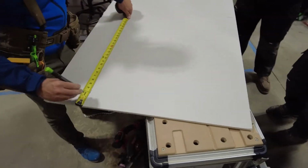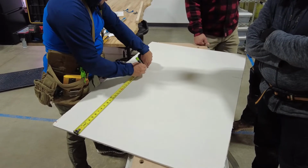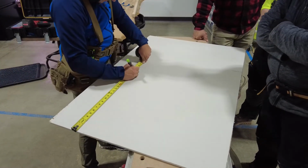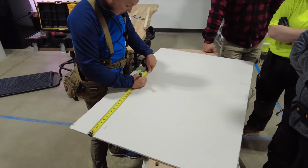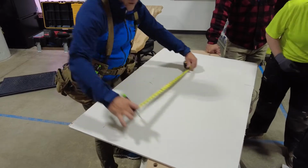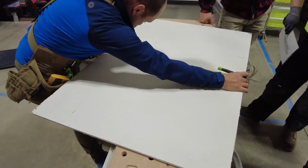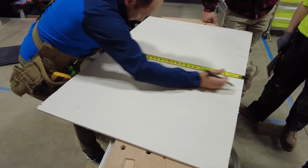All right, here's a little trick. I'm going to use pencil lead. This is a straight edge, right? I let it come off a little bit. It's not flat on there, so I can go squirrely. I leave it up, and then it's barely touched, but I keep my hand the same, and that's my line, right? So how far were we? 22.5? So I made my mark, and now I know my reference point. I wasn't out here trying to mark 22.5 and then transfer it over. I knew exactly where to make that mark, right? So what's this mark over here? See, 22.5. And go past my world. Always scribble out your mistakes.